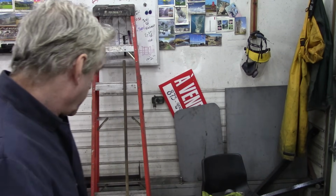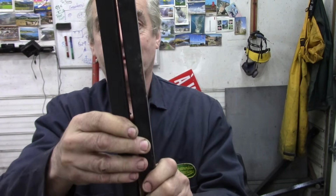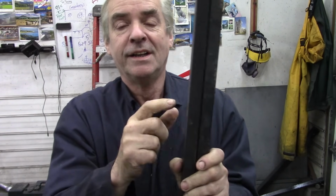Now, of course, when we were welding this axle up, we couldn't really see if it was warped or not, and that's where these bars come in. These parallel bars, donated by Olga Korbut, that famous gymnast, are nice and square. They're straight, and there are no air gaps between them to show that they're twisted. So these are going to be our guides, and we're going to exaggerate the flanges by clamping these on the end and measuring it up to see how far it's out. Hopefully it's acceptable, but if it isn't, we've got a few tricks up our sleeve.